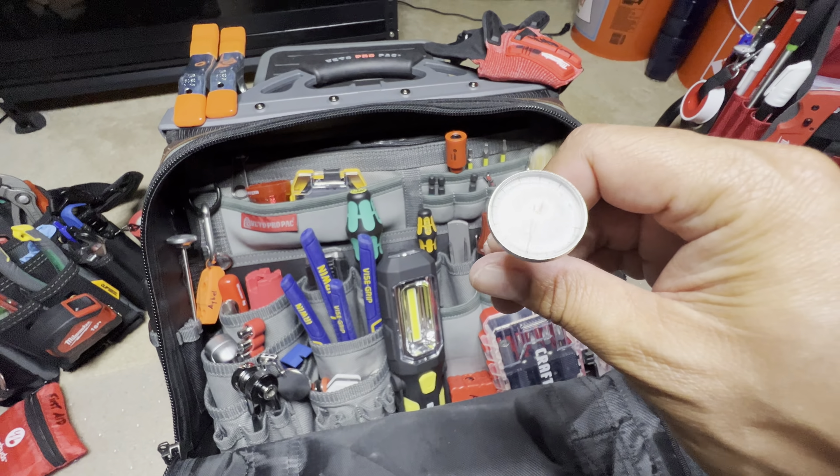Let's try to be systematic about this so I don't miss anything. Just regular needle nose pliers here. I use these for the little O-rings — you can see they're nice and round. The one thing I hate is using a slotted screwdriver to get an O-ring out, because if you cut it or scratch it, you can't use that O-ring. It's over for that O-ring. So you need something like this. If they're not dried out, you can lube them up and put them right back on.